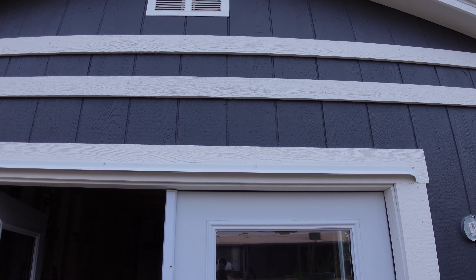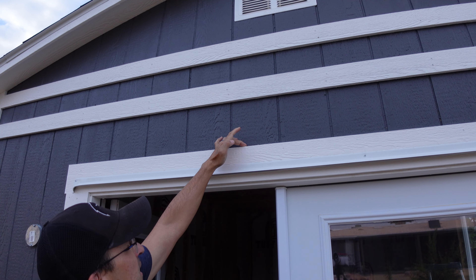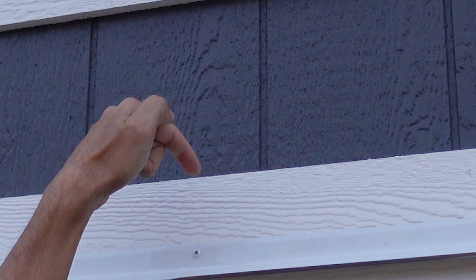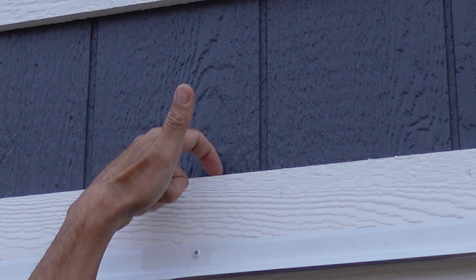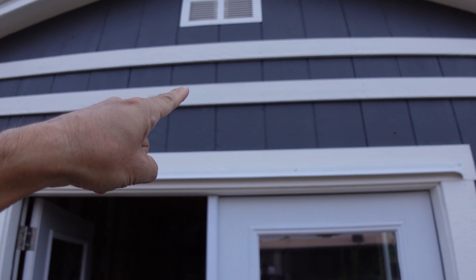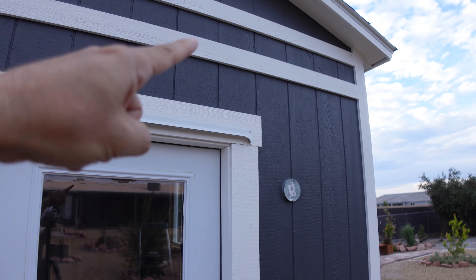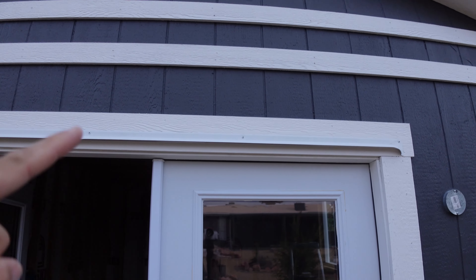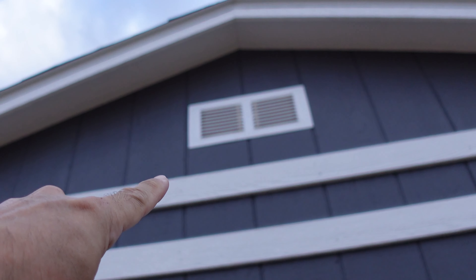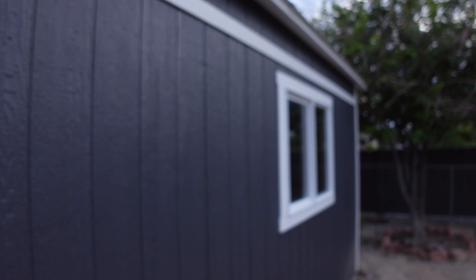After inspecting that a little bit more, I was able to determine that the water is leaking in into the top of all of these panels here. These aren't sealed at all against the exterior of the shed, so any moisture that comes down from the outside is going to seep in through here. So what I'm going to do is go around the entire shed and seal all of these pieces of trim up with silicone caulking, all the way around the edges of all the openings. I'm going to have to hit all this side trim, probably up around that vent, and make sure all this trim on the side and all around the window are sealed as well.